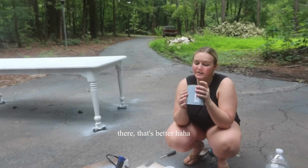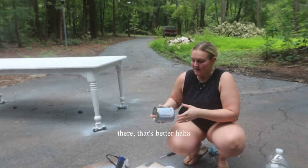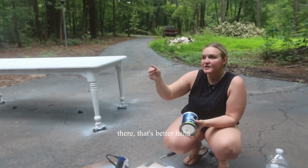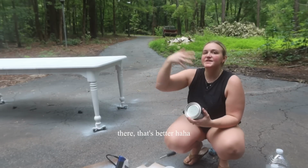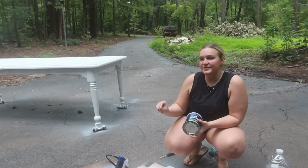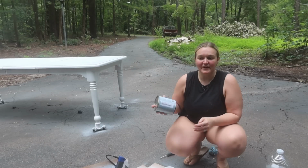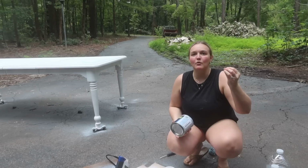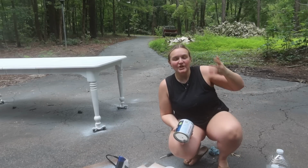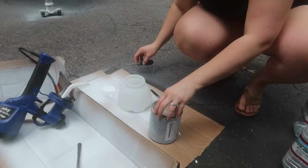So I chose this Nomadic Desert. It's a very, very, very light tan. And I'm hoping with a lighter base than what we did on the chairs, the table itself will turn out lighter. Also, there's a lot less cracks and crevices for the gel stain to get into, so I think overall it'll be a much lighter finish, but it should take us back to more of that natural wood tone at least. So the whole tone of the table is about to change when we put this on.